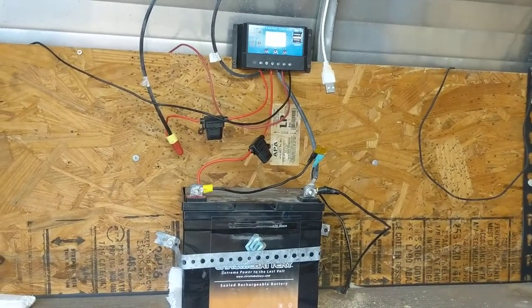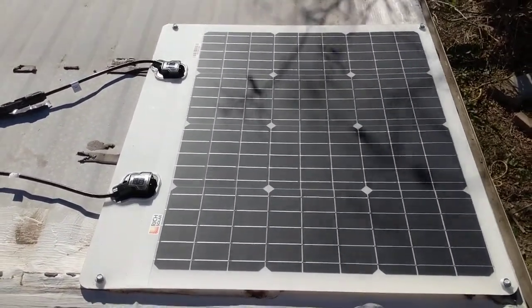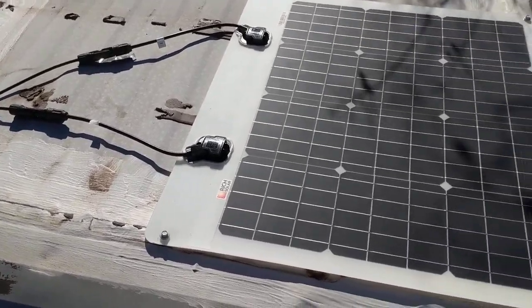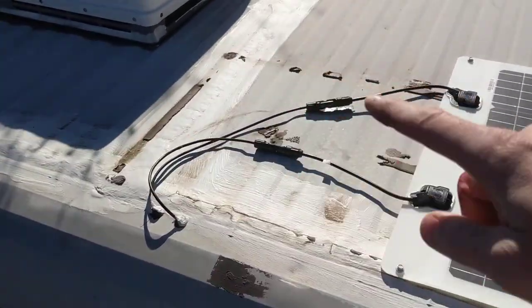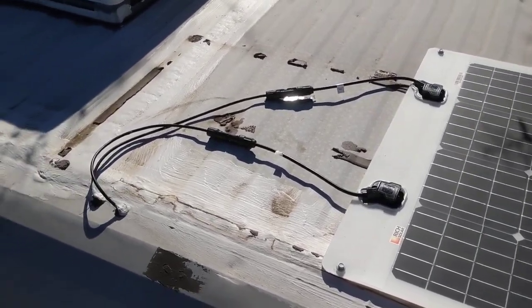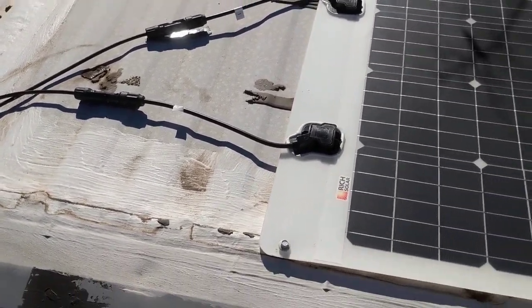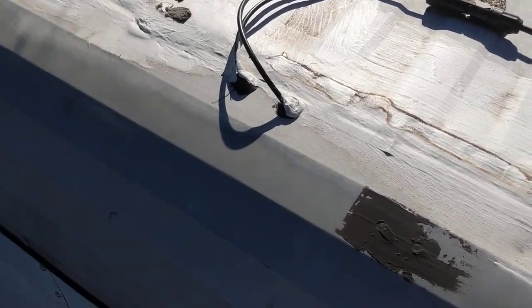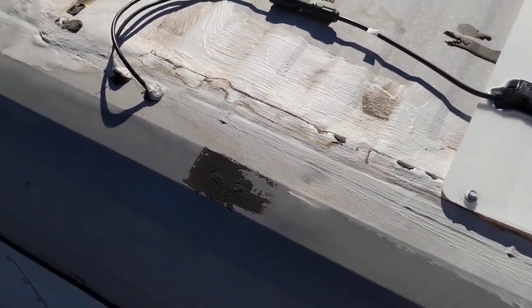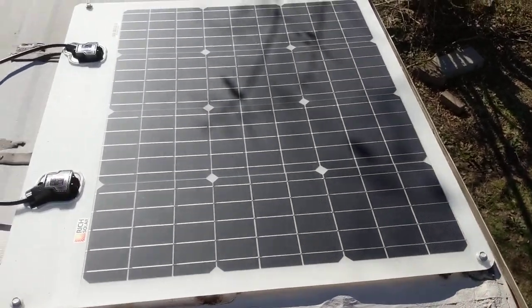Alright, now let's go out and look at the solar panel. It's kind of windy out here, so sorry if you're getting some air in the speaker. So this is just a 50 watt panel — I find that's pretty much all that I need because it's such a small battery. I used to have a 100 watt panel as outlined by the adhesive, but since the adhesive tore off with the panel while I was driving and blew off to who knows where, I just decided to replace it with this 50 watt. It's got these little quick connectors — just plug in, drill a hole through the roof, and put some elastomeric caulking around it. That has been nice and watertight with no problems using the right kind of sealant. Just screwed at four corners, and it sits there like so.